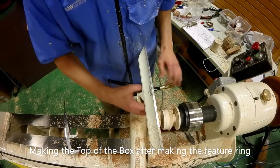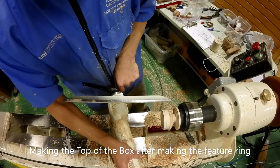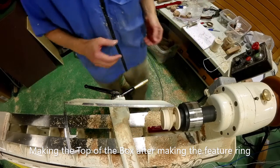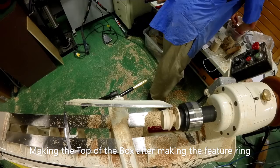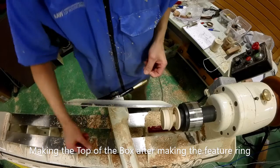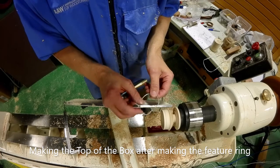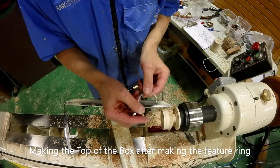And now in the next part, I want to make sure that I'm okay if I don't get constant thickness. That I'm okay with for the lid, but I'm not okay if the thickness really becomes very, very large. So I want to avoid that. So you can have all sorts of calipers for that, but this is my hi-fi caliper. I often go just for these boxes. Just a piece of wire that is bent such that I'm wider than my widest part, because I only want to have one side touching, not the other side.